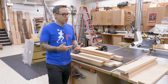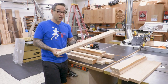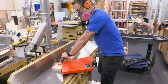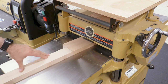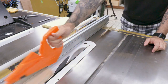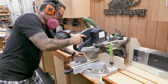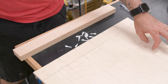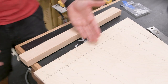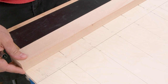With everything rough cut, we think about strategy. For the slats, we'll resaw boards down the middle — but since this wood is fresh into the shop today, we want to let it acclimate a bit first. We move on to joint and plane the frame parts to final thickness. Before constructing the wacky top rail, we need to think about drilling. On the largest stile, every center point of a louver is where we need to drill, so we bring the workpiece up against the template and mark those locations.